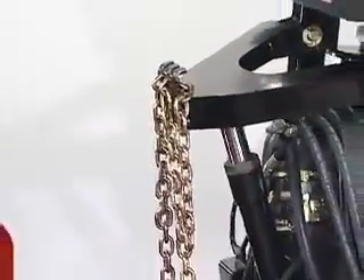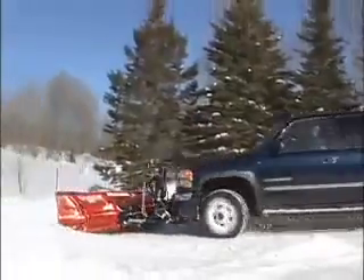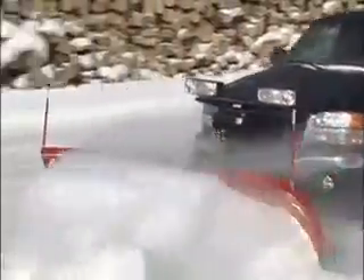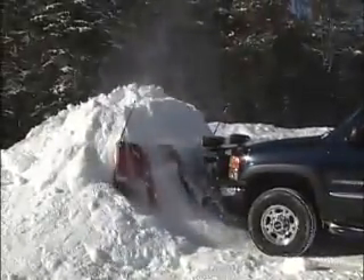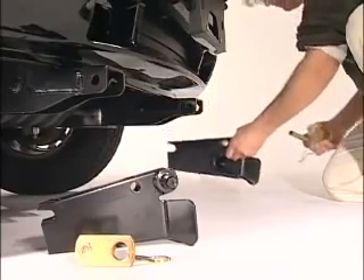Western's Ultra-Mount also features a chain lift, a simple mechanical system that offers several advantages over competitors' hydraulic lift systems. First, with the chain system, you get instantaneous float when lowering the blade — unrestricted, the blade can freely follow the contours of the plowing surface for a cleaner scrape. Second, with the chain lift, you can stack higher because you're not limited by the hydraulic ram stroke, unlike cylinder lift systems which can only pull the plow up as far as the limits of the cylinder's range. And third, in the rare event of a hydraulic failure, you can push the plow up into a snow bank and short-chain the plow, and safely transport the plow back to the shop instead of being stranded. For full ground clearance in the off-season, the receiver brackets are easily removed — no tools needed.